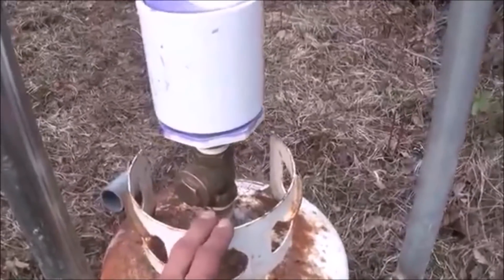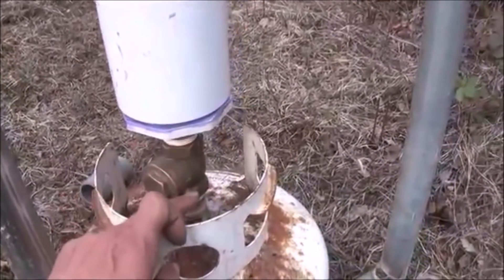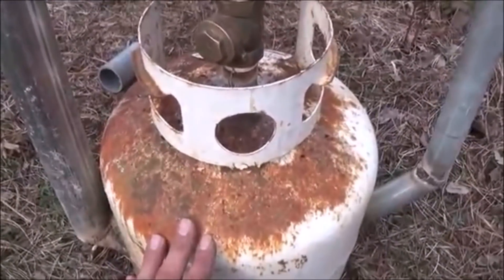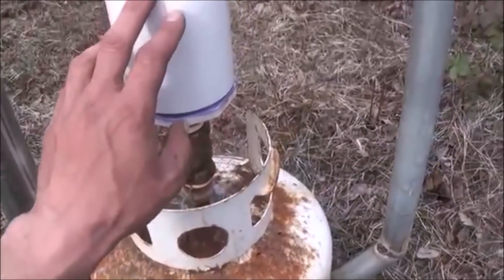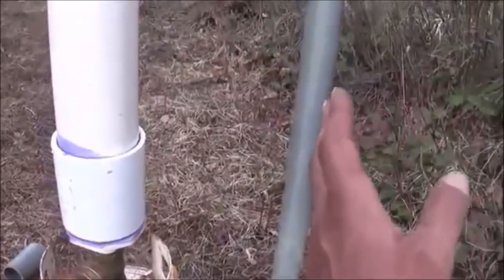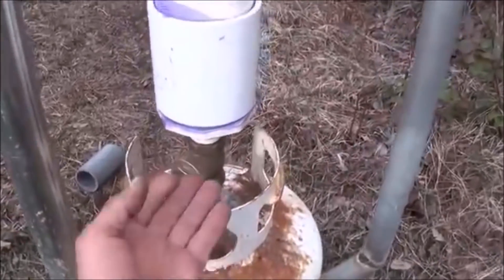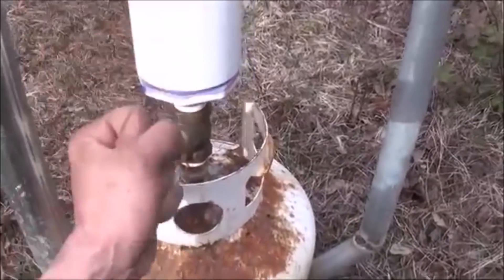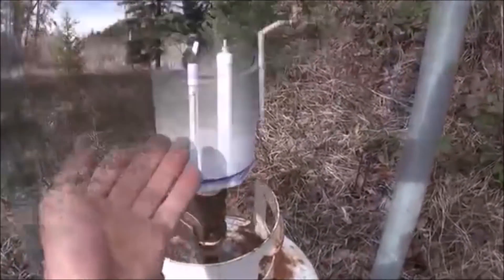Once the upper cylinder is full of air and the pressure is greater in the cylinder, this one-way valve will go closed, capturing that air up in here and making sure that nothing from down here at lower pressure can get back out of this upper tank once the water ram effect takes place, locking it into place. Because once the water ram opens back up, the pressure will be lower, and if you were able to build higher pressure in here than through the system itself, each time some of that pressure could blow water out and lose its gains.